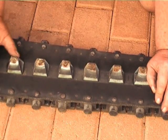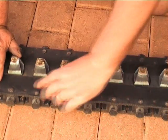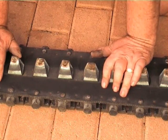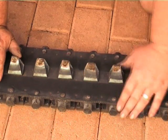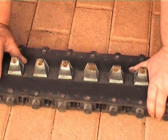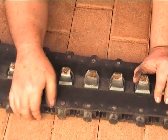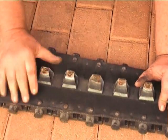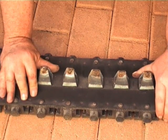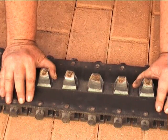The big thing about using conveyor belt rubber is that apart from it being reinforced, it doesn't stretch. That means that when the tank is turning or slewing, there is no lateral twist to the track. As you can see, it takes a fair bit of force, and with the weight of the tank on the track, it will not twist, which could cause you to shed a track.